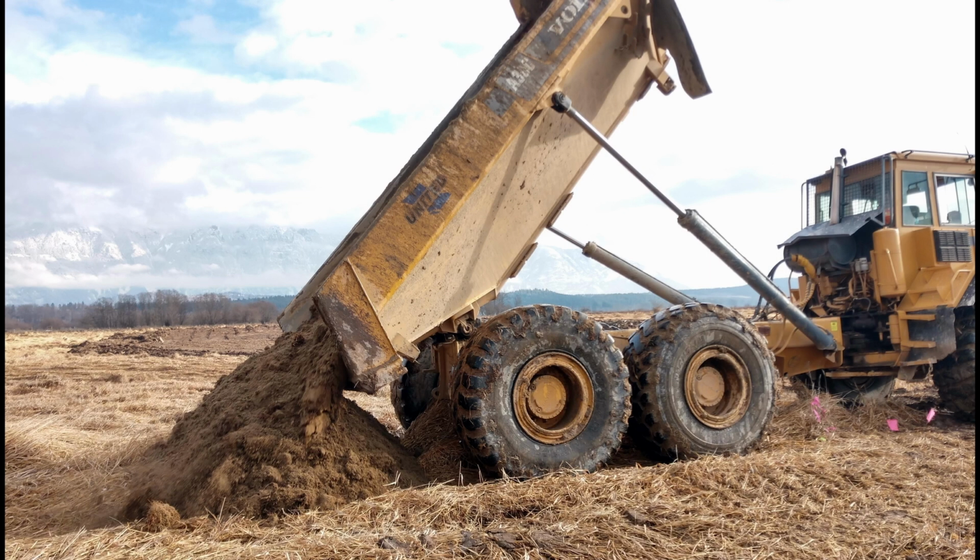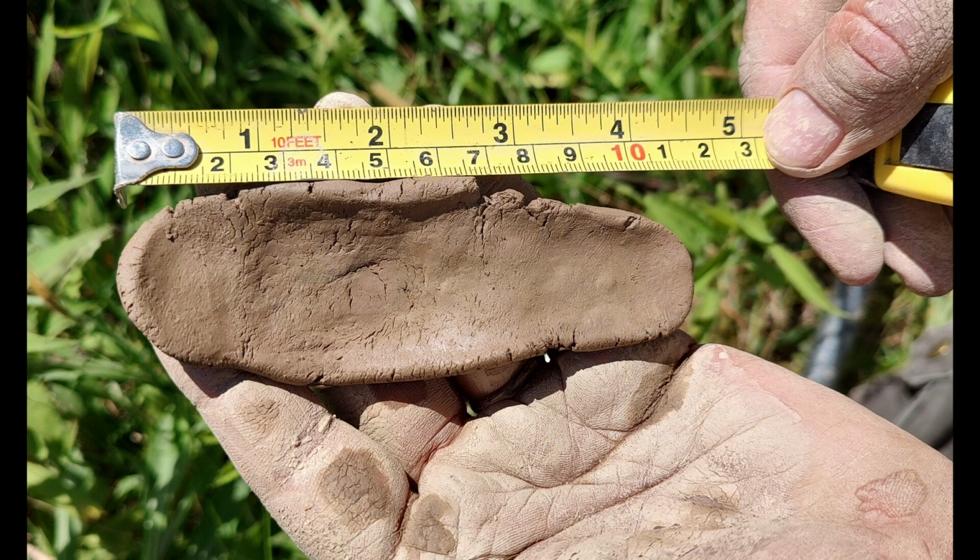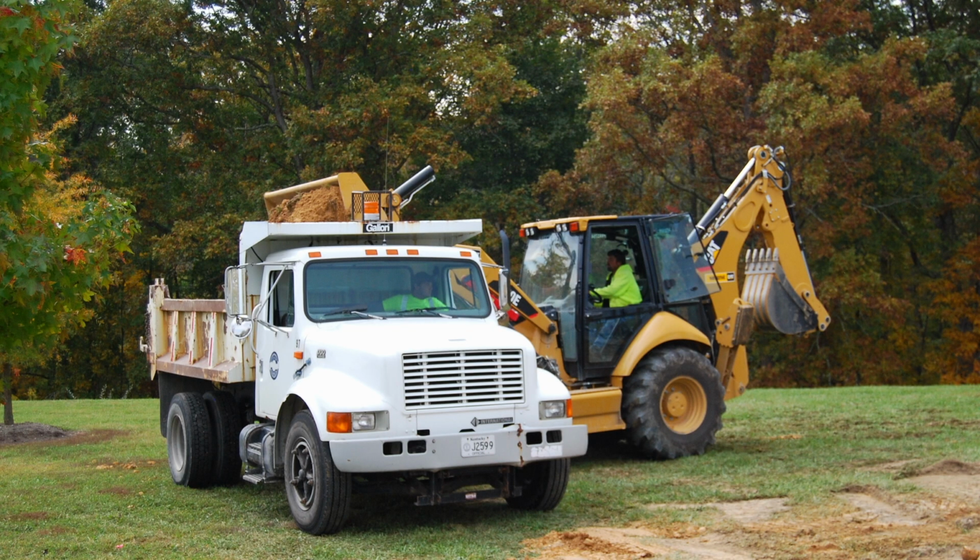One must identify the source of clay needed for the project. The clay may be obtained from a gravel pit or a quarry, or possibly another wetland you're building that has excess clay. It's of critical importance that you examine and test the percentage of clay at the source before moving it to your site. Another thing you need to consider is what will be done with the permeable soil that's removed from digging the basin for the wetland.